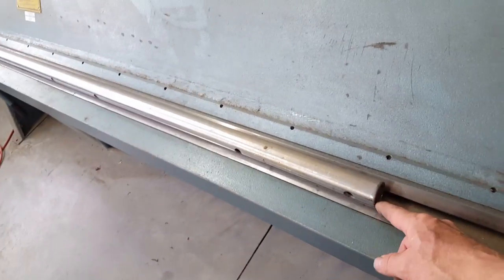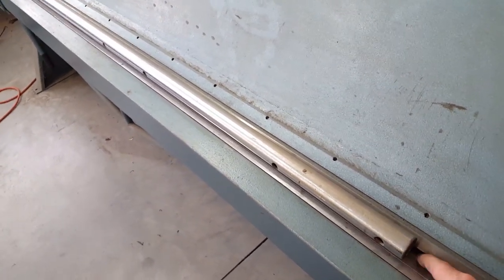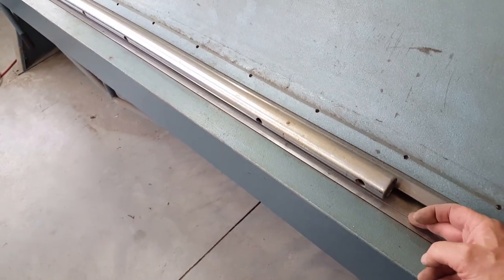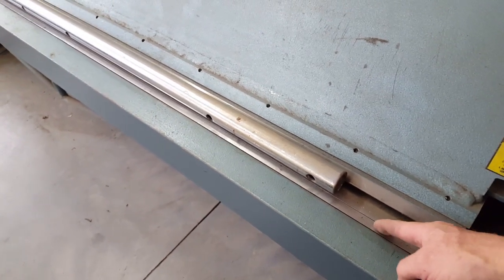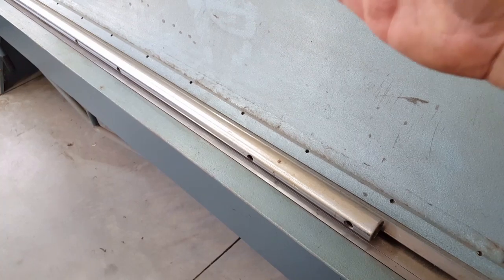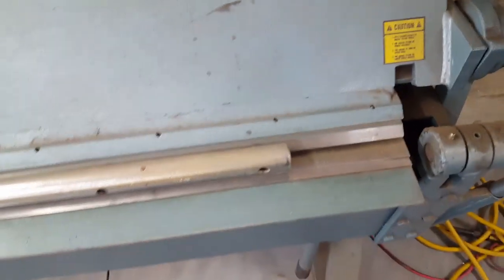And you can certainly get smaller than this. You can put 3/8 or 1/2 inch or whatever you need, and then bring the jaw out to where the edge of this pipe is right where the split in the brake is. And when you roll it up, it'll just pull it right up around that piece of tubing, and you get a nice clean round edge.